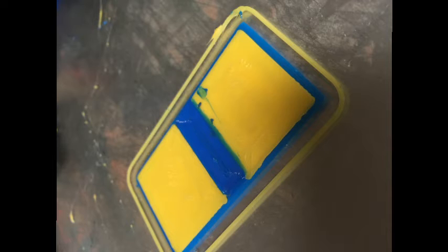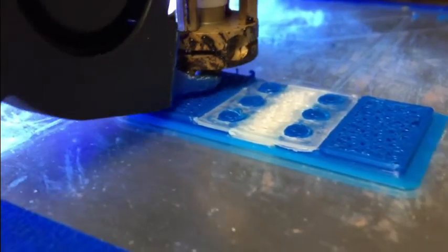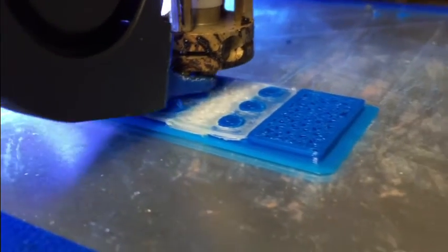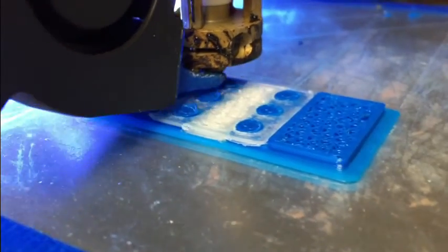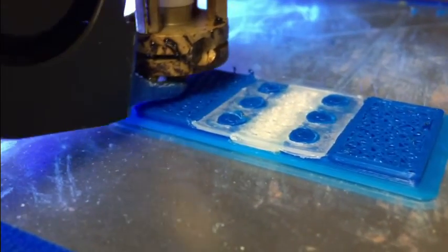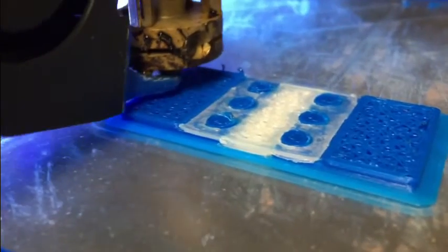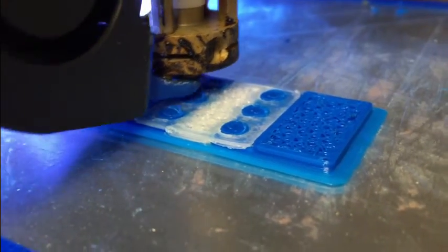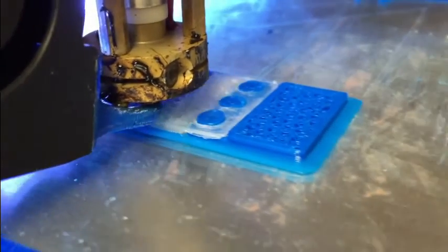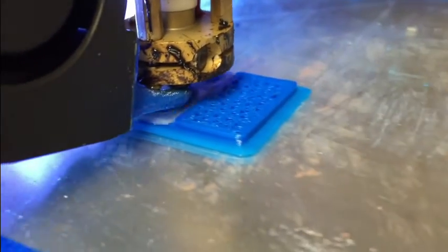To do this in reverse, using the onboard camera of the printer, simply connect to that and using a G-code file that is already loaded online, draw two X's using the nozzles. Instead of centering on the center of the nozzle, center on the center of the X and then jog over to the other X for the other nozzle.